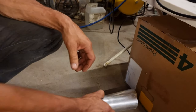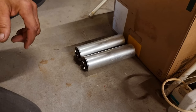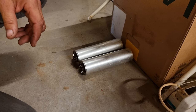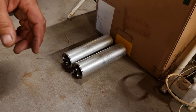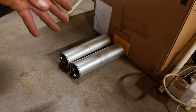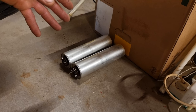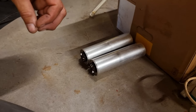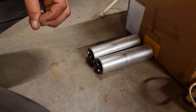And are you relying on the natural discharge cycle to drive it, or have you got any means of triggering the discharges? The discharge has to come from the relation between the maximum voltage and the vacuum. I mean, when the vacuum is not low enough, it will not start. Or you have to increase the voltage. Both, that's two parameters you have to control to get the plasma running.